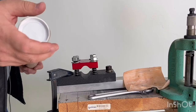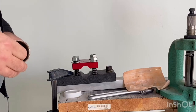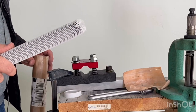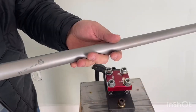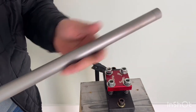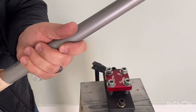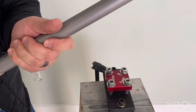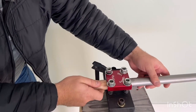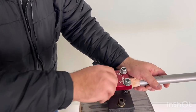The new barrel came packaged in a tube with a lot of paper wrapped around it for protection. I've already run an oil patch down the barrel to clean it out, and I've checked the overall length for the 140 ELD-M I plan to shoot. The barrel has laser etching all the way around so you can see what it is. It came with a thread protector, and I got the MTU contour so it's pretty beefy — I'll be using this for competitions. I wrap cloth around it and slide it into the barrel vise, being careful not to scratch it.